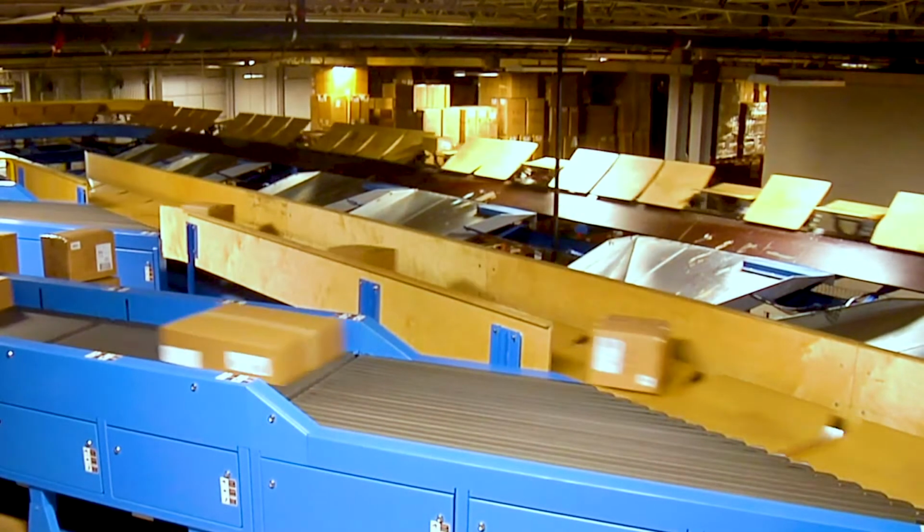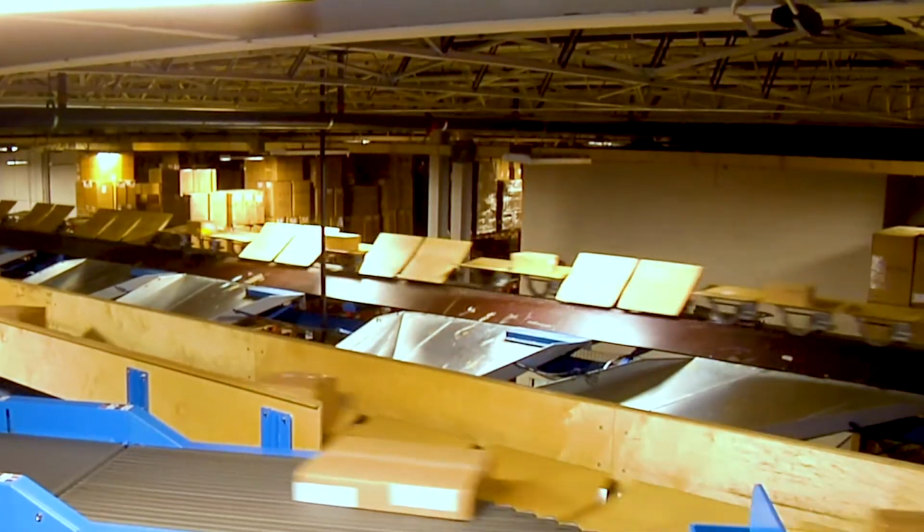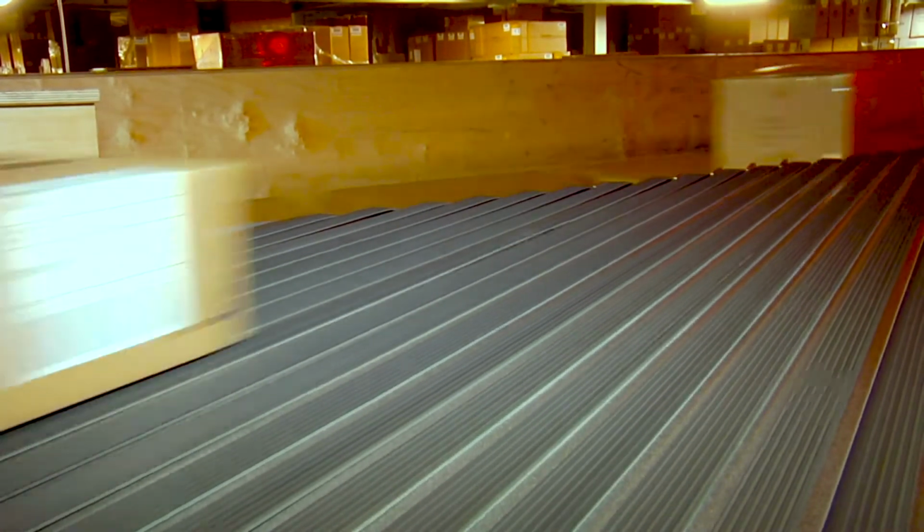We have two sorters, a heavy duty that handles 77 pounds per tray, live load. We have the smaller unit, which we call light duty. It can handle 22 pounds of live load. What's special about it is it's simple, really. It's easy to maintain. It doesn't require computers at every divert. It's very versatile on sorting anything from boxes of clothes to microwave ovens.